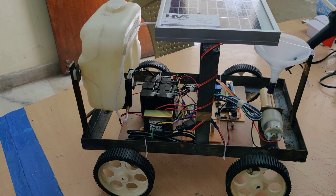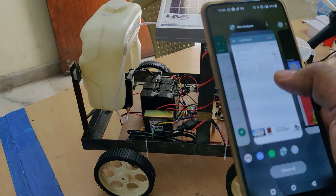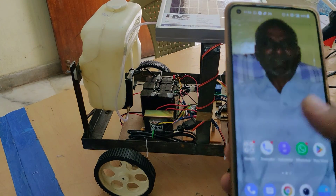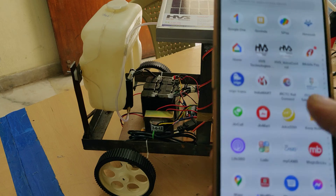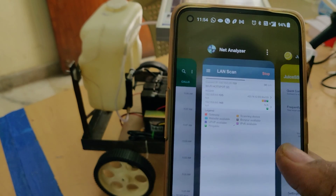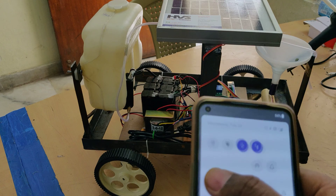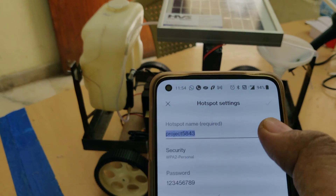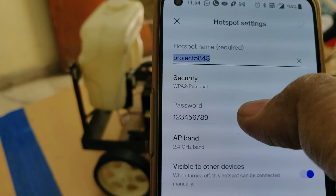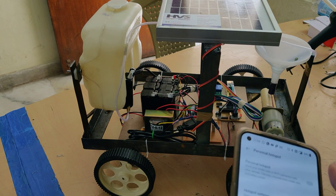Before turning on the kit, keep the battery under full charge. Next, install two applications on your phone from the Play Store: the Network Analyzer application and JuiceSSH application. These two applications must be installed before execution of the project. After successful installation, go to the hotspot settings of your phone. Change the hotspot name to 'project5843', all lowercase letters without any space. The password should be 123456789 and the AP band should be 2.4 GHz. After these settings, turn on the hotspot.